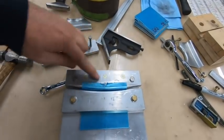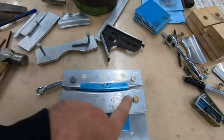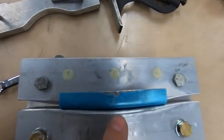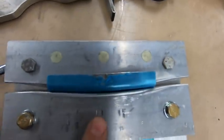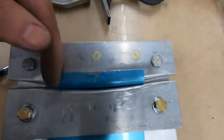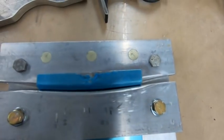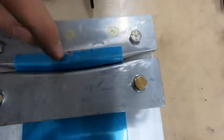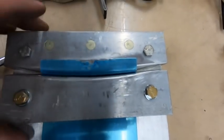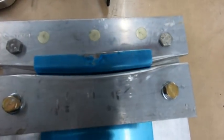So remember, this form block for our second bend is not the correct radius — it's just a generic one that I used. Here you can see that it doesn't have quite the same contour as the form block for that particular frame segment. You can see there's a gap in there, and that's not cool — when the rivets are driven through, if that doesn't match the frame it's going to pucker. Now if I shrink it, I can bring it in tighter and knock it back down and it'll fit correctly. So basically saving a lot of tooling but having to add a little bit of manual work to correct the profile that forms with that block.